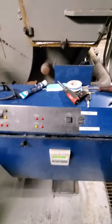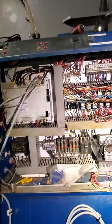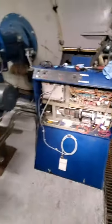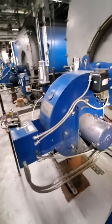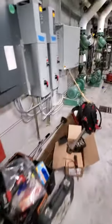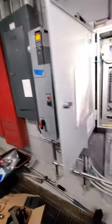how the boiler operates and what each component here is, from the transformer, the three-phase, the flame safeguard right there, that one that I'm pointing to, this one, the flame safeguard, the motor starter, line starter, the relays, the burner itself, the rotation. I'm gonna explain even my VFD, my variable frequency drive, right? So this one, I'm gonna explain them.